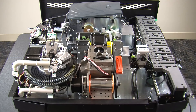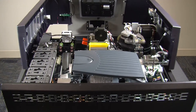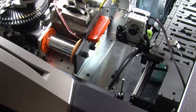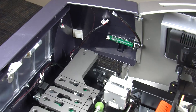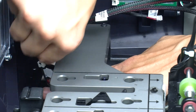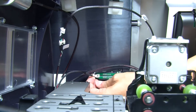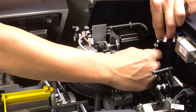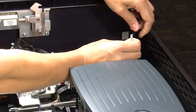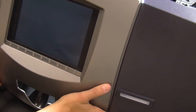Make sure any loose cables are out of the way so they don't get caught under the front cover. Grasp the front cover on either side and gently slide it into the front of the EC2000 so that it's resting on the base. There are a total of five sensors and two cables that need to be reconnected. The first three sensors are in the front corner near the card hoppers. Looking below the card hopper baseplate, reconnect the door one sensor. Just above it is the exception card entry sensor. The bezel LED sensor connects with the interior of the exception card entry slot. Reconnect the power and VGA cables. The last two sensors are on the XY assembly side — toward the middle is the door two solenoid, and in the back is the top case open sensor. Once the two cables and five sensors are reconnected, gently push the card exit tray area of the front cover so that it locks into the base of the EC2000.